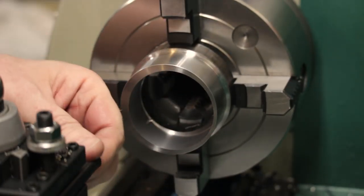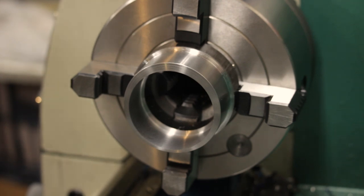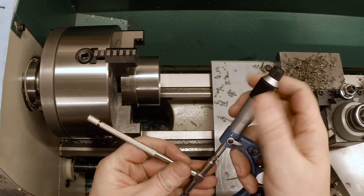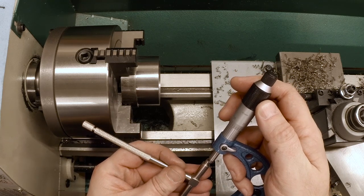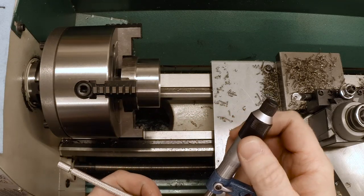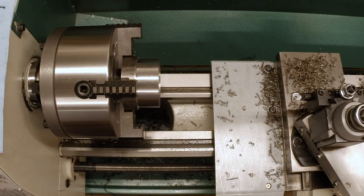Cleaned up, and the surface finish in there I would say is acceptable. So I'm going to take a measurement carefully and see where we are, and then look at taking the rest in two passes. Okay, we are currently at 411. Take another measurement. And that's about the same thing. We're right about 411. And we're headed for 487, which means I need 38 to go.